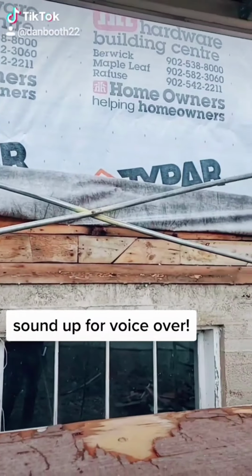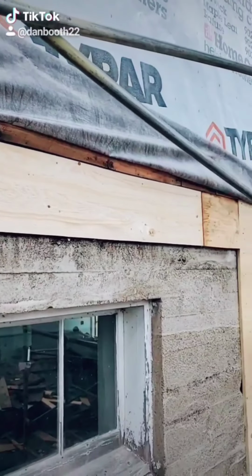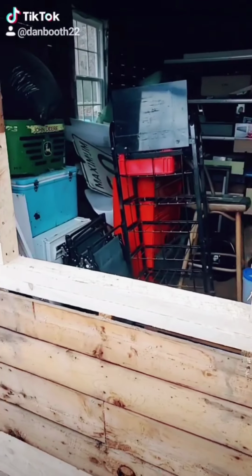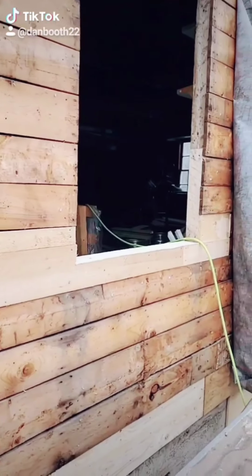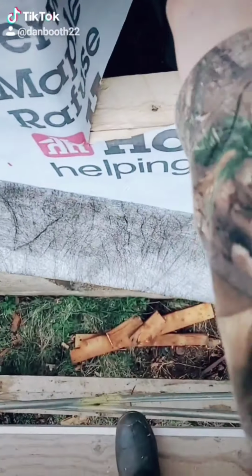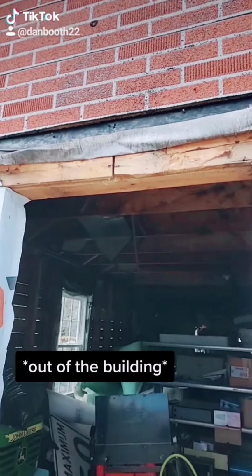There really wasn't a whole lot wrong with them. They were just pieced in, so I decided to replace them. These ones, however, had some water damage from the window leaking, so I replaced them with boards. I used a piece of clapboard to bevel the sill in case water does get in. This will shed the water forward.